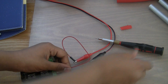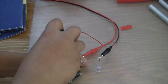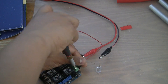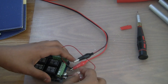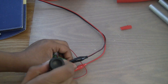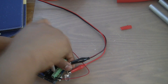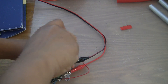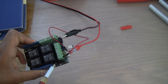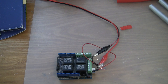Simply put each one into the corresponding slot. It doesn't really matter if you mix up ground and positive, because this doesn't really use those polarities — all this does is join the two leads when the relay signal is triggered. So now just proceed to screw the rest of them into place. And if you do this right, it shouldn't be glowing. Again, it's COM1 and NO1. Those are the only ones that should be connected right now.